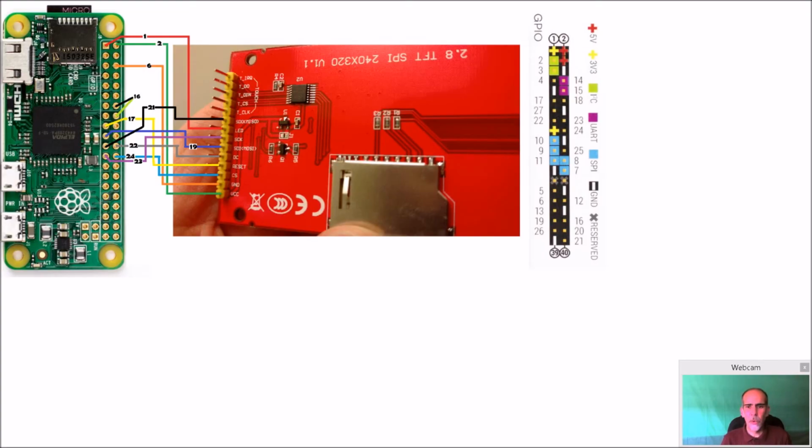So here's how we're going to connect it. So like I said, on the Raspberry Pi Zero, you can put the header on there and use little things like these little guys here. These are from an old ATX motherboard. The problem comes in, space is very limited in this unit. You don't have a lot of headroom in any way, shape, or form. You need to make things as compact as you can. So I actually soldered directly to the GPIOs. This is pin 1. The square one here is your GPIO 1. Then you go to 2, 3, 4, 5, 6, 7, 8, 9, and so forth, all the way down.